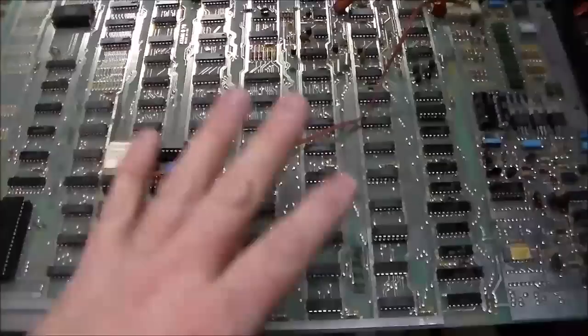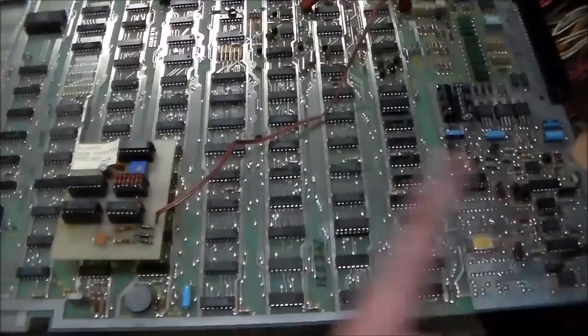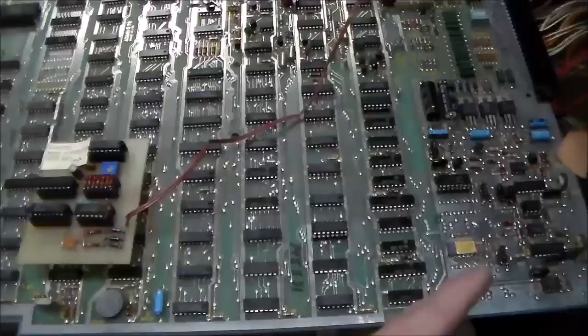So then once I figured out that everything in that section's probably fine, remember I said I went to the output stage and I figured out that it was this chip on the output stage. But I didn't figure that out first. First, I tried swapping the digital to analog converter. It was just like this one if you rewind the video. So first, I tried swapping that. And those aren't really that cheap either, by the way. Luckily, I was able to pull the old one out and didn't screw up any pins or anything, so I've still got it. But that didn't fix it either.